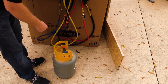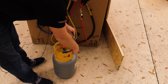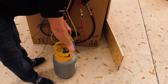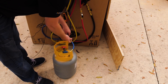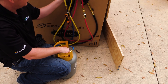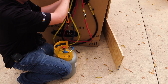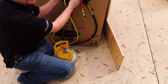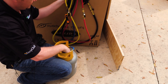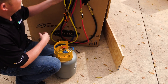I'm going to use the suction side hose and connect to the vapor port. I am going to purge the line as I open it. Make sure everything's shut first, then purge the line a little bit just to make sure we get all the air out of it.